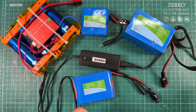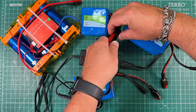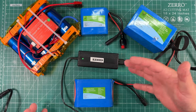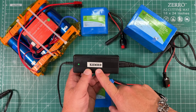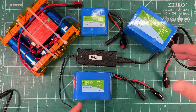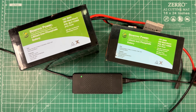I've standardized everything in my 12-volt system to use Anderson power poles. I made a little pigtail so I can plug the power pole into the battery and charge just the same. For smaller batteries, we're generally going to want to use a smaller charger. There's nothing wrong with using a small charger on a really big battery — it's simply going to take longer. A 2-amp charger on a 100 amp-hour battery would take 50 hours, but the slower you charge a battery, the better it is for the battery.